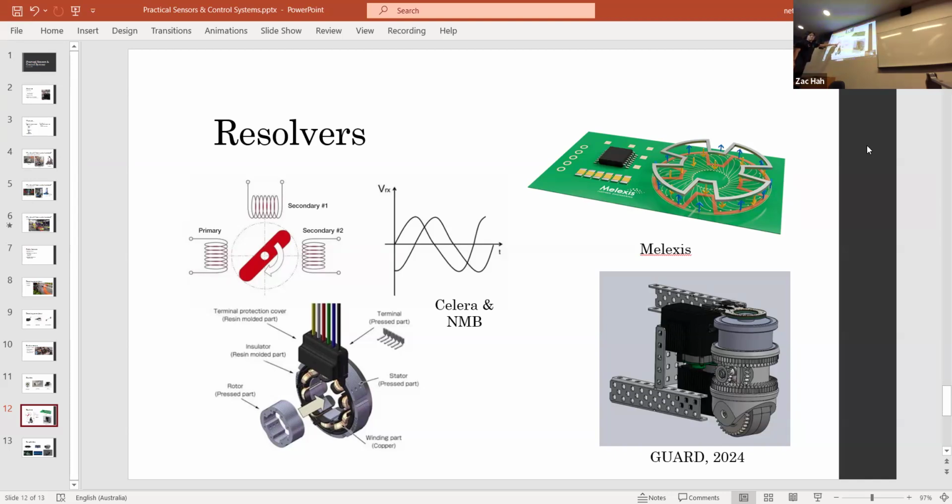Right. So basically there's a magnet inside the part that's rotating, and then outside that there are a couple of sensors that can detect magnetic field, and then between all those sensors you're able to work out which way the magnet has rotated to, like what angle it's at. Yeah, is that roughly what's going on? That would be a magnetic encoder.